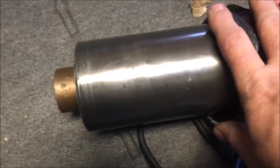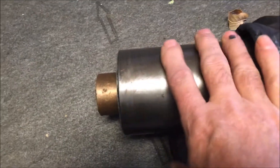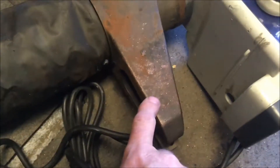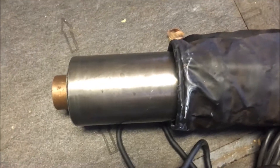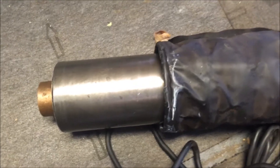Here's the cross feed that was in there — it came out beautiful. There's like a perfect clean layer of grease on it. But this thing was so wedged in there I had to pound on it with a copper hammer for about three hours to knock it out, with about a half a ton of screw tension. It was locked up solid.